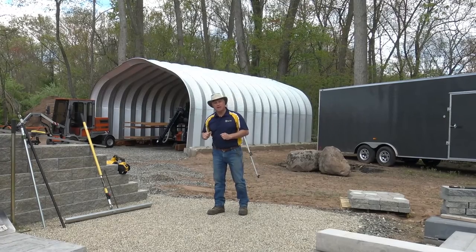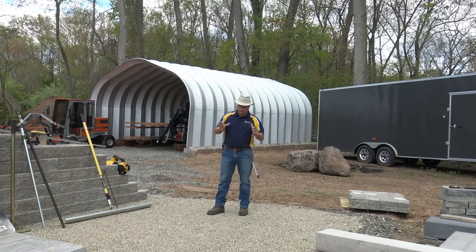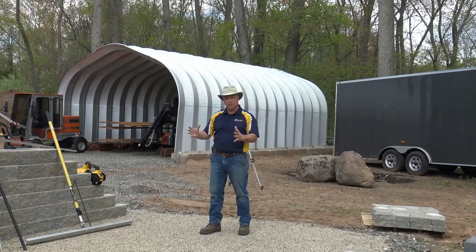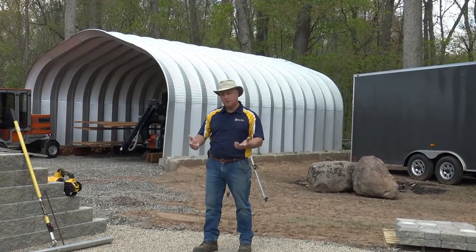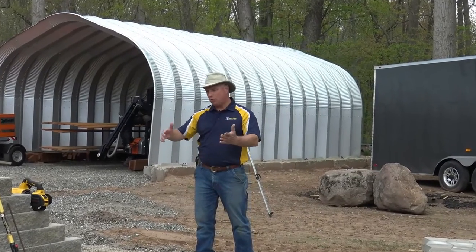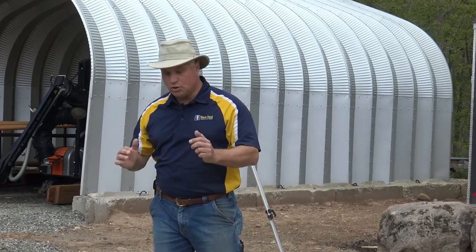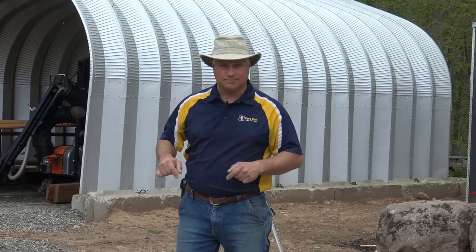Another thing I would highly recommend not doing, and that is putting your fire pit on top of your paver patio. Do not lay it directly on top of the pavers. You want that to move independently because it's a lot of weight. You get the weight on the edge of a paver. If you have a small paver, next thing it could settle that area because of the added weight. So I'm gonna show you how to get that area dead level.